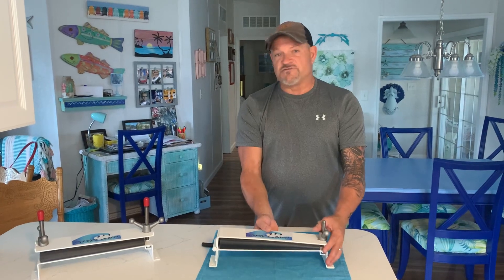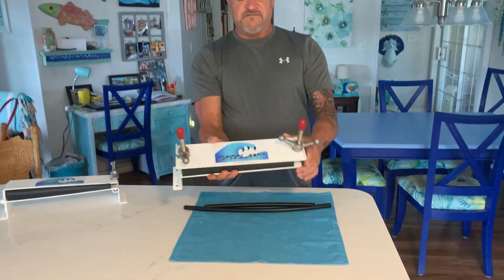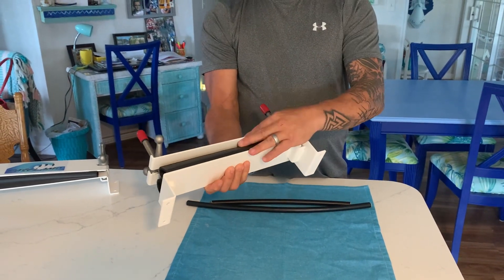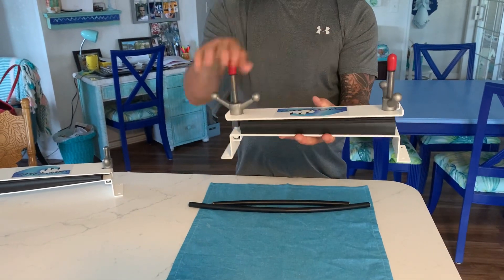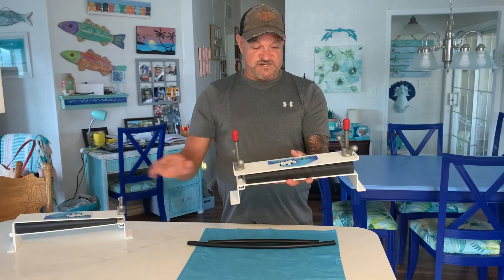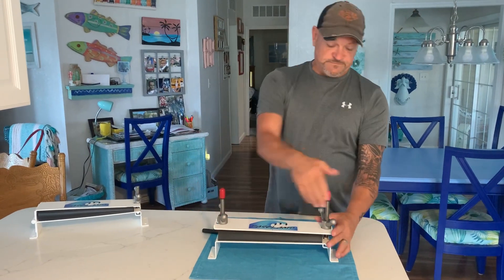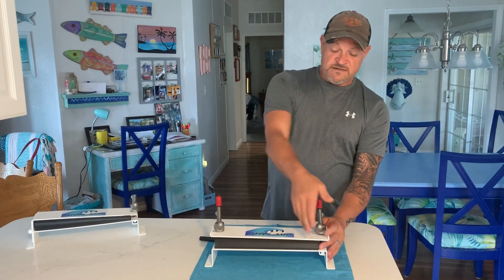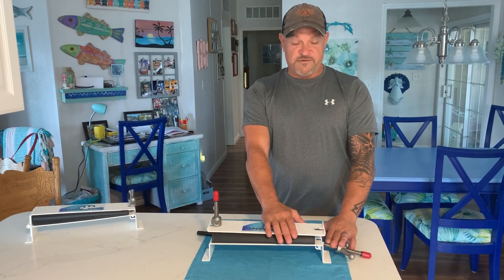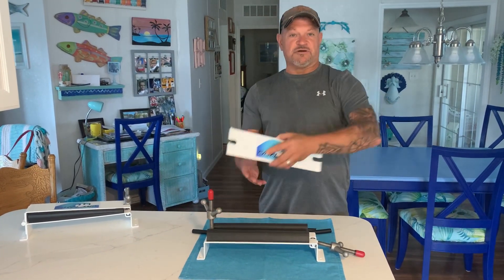As an alternate option, we came out with the next clamp — this is called Fast Clamp XL. It's made out of the same durable steel and is powder coated. The bolts and nuts are stainless steel, just like on the original. The slight difference here is I removed the hinge. This allows the top portion to be moved — the forward nut remains pivotable, and you can back off the other nut to allow the top plate to come completely off.